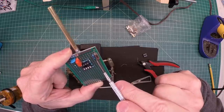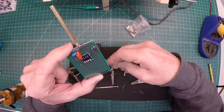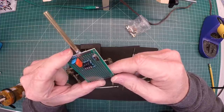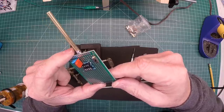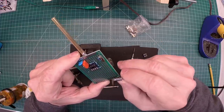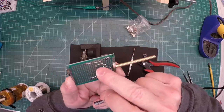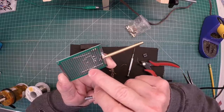C4 ties from one side of the resistor to ground as notated on the schematic. I did play around with a couple different values to get the best response out of the signal tracer — anywhere from 3.3 to 4.7uF worked best for me. When I started getting up to around 10 or more it created some distortion I wasn't happy with. It does create more bass and more gain as you increase the capacitance value, so you may want to play around with that. You can see the other lead off of the resistor that I'll tie into the cap, with the other side tying into the ground rail.